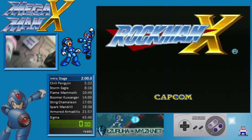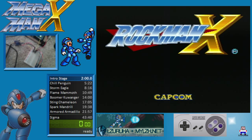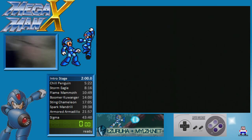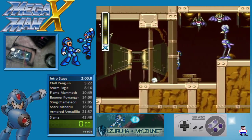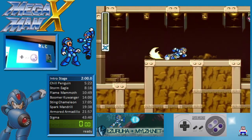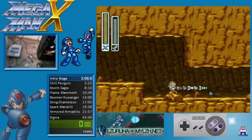As you can see, I have down here the Super Nintendo controller spliced in the middle, going into a breadboard, and then the breadboard comes to this other side of the extension cable, which runs to this controller. In the middle, I've tapped into the serial pin, the latch pin, and the ground, and hooked it up to our Arduino, which then runs to my computer and is run by this code here that produces this picture here, put on the stream so that it captures the input from the controller while actually playing this for the Nintendo console.